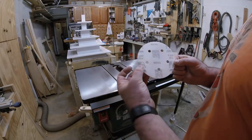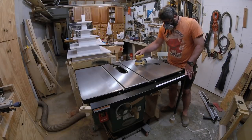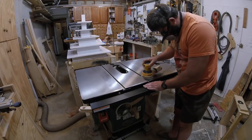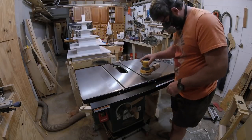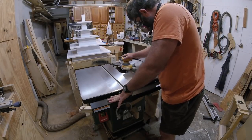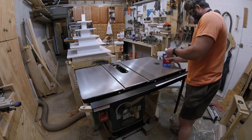After I've got the top clean, I sand it with 600-grit paper using a random orbital sander. Since I have a small shop, sometimes I have to use my table saw for glue-ups — I know that's a no-no — and that sometimes leaves deposits on the surface. The sanding ensures that most of what was left behind is gone, or at least flush with the surface of the table. After I'm done with that, I give the table a good cleaning once again to get rid of most of the iron dust.